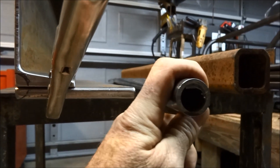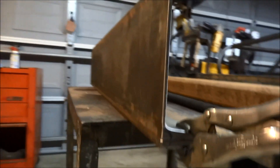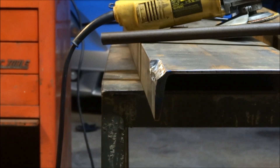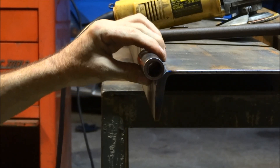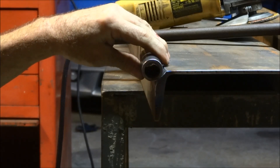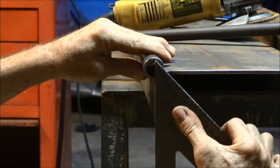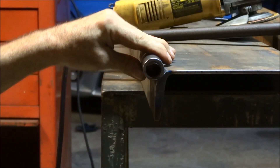I'm going to use this piece of tube — it's DOM. I've got a piece of three-quarter rod that I'm going to put inside of it. Cut the corner off with a plasma cutter. I need to get this — which is going to be my hinge — over the top of this rod, cut out so that it's low enough to be centered here and at the center of that, so my pivot point is perfectly centered and I can make a square bend.